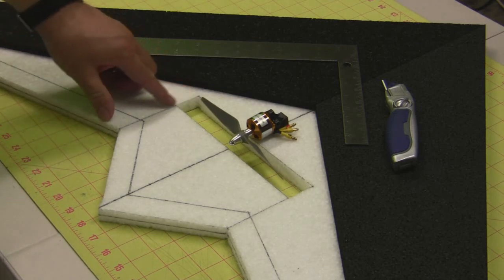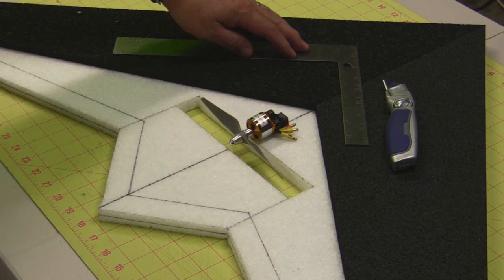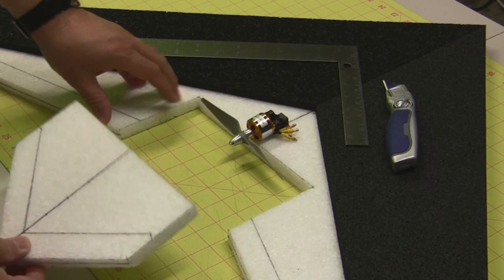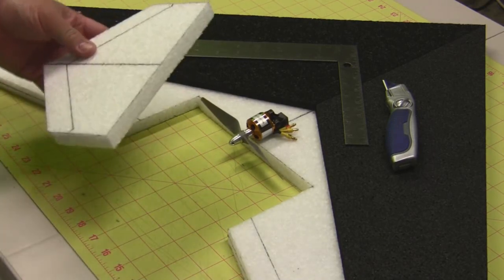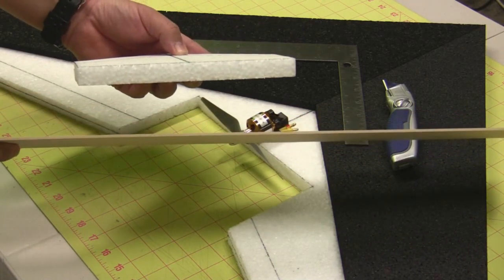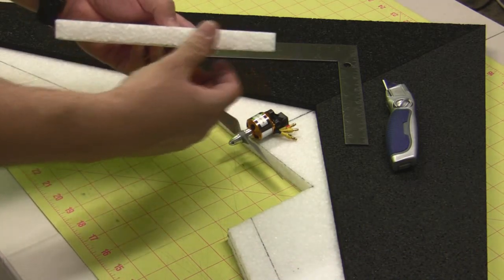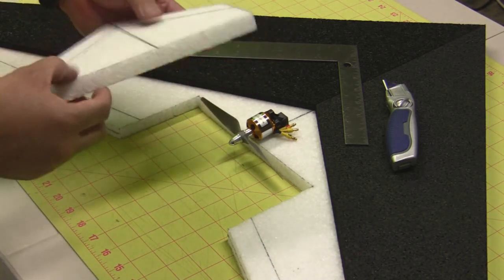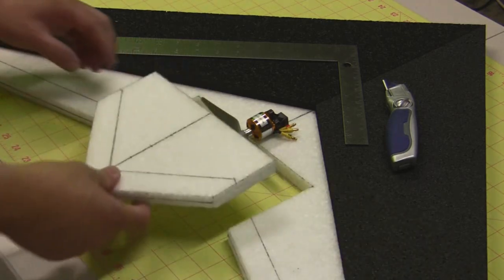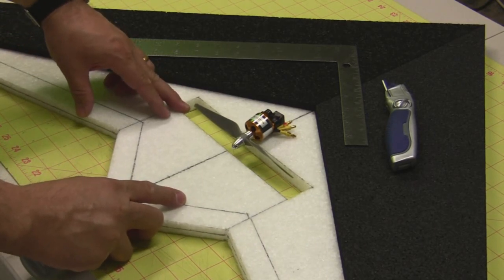As you can see, I've gone ahead and cut through the foam using the box cutter and the square, the same as we did before. This piece is going to come out of here and we're going to be replacing it with some thinner wood. This should help the airflow better because if we would have left the foam on there, this would have caused a lot of turbulence. So we're going to replace that with the wood plate instead, which will take the same shape as the foam and be placed in the same spots.